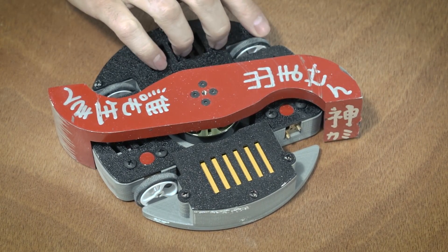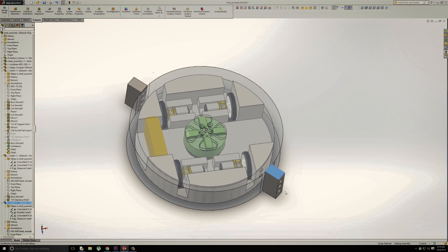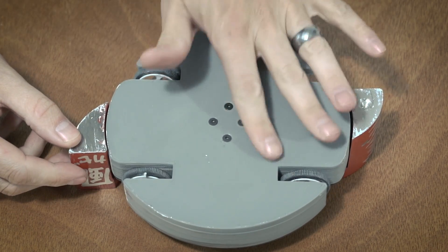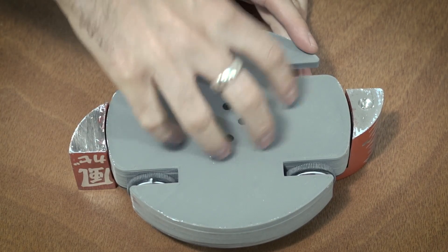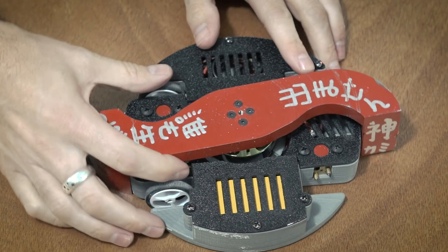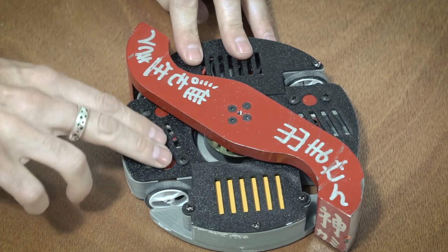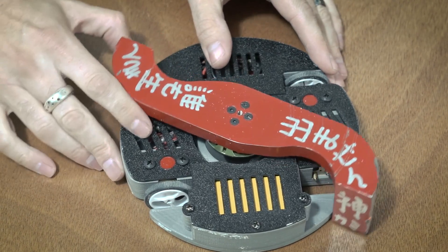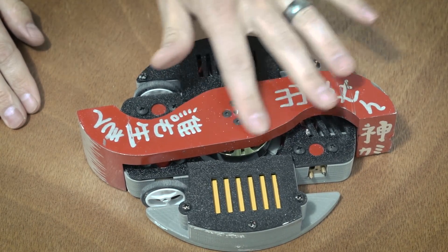The overall design of Kamikaze was based on a full-body shell spinner that I never really got around to making. So it has this 3D-printed chassis or frame that sits inside, and everything is kind of bolted to it. It's kind of similar to Sergeant Cuddles — it just has the one-piece frame. You've got the four drive motors in the corners, the battery compartment, the electrical compartment, and then in the middle you've got an outrunner motor that connects directly to the weapon itself.